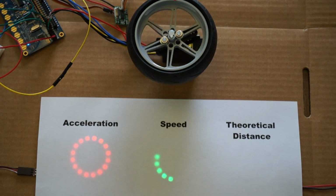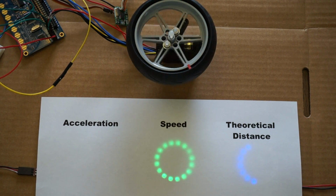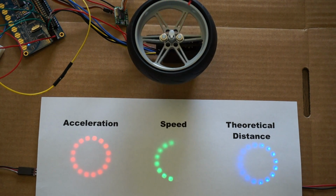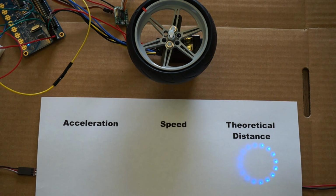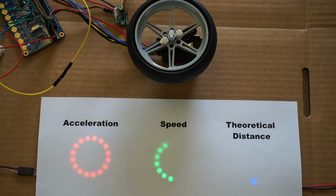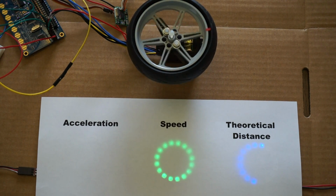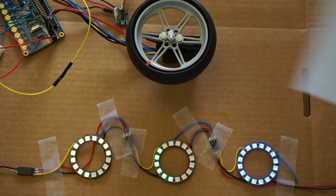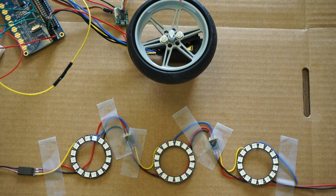Now unfortunately, I wasn't able to mount either the magnet or the little circuit board very precisely inside the servo. In fact, the circuit board is just stuck to some foam core board and is kind of wedged up inside the servo, and so it is not in a very precise position. And that shows when we actually go to get position feedback from the servo. I'll switch modes here with the LEDs, so we're not using this mode anymore. Okay, this should be the position feedback one.